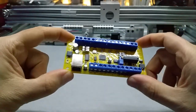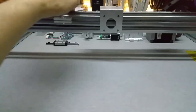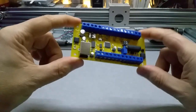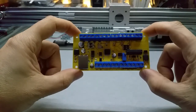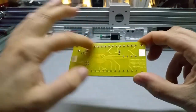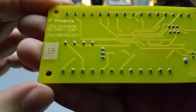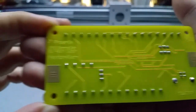I did this also so I can use it with my upcoming pick-and-place machine — I'm still waiting on some parts, but that will help me work more efficiently. I reflowed this in my toaster oven, which makes my life much easier. The through-hole parts I solder by hand, and I can show you the back — my solder joints look pretty good and I have plenty of experience with that.